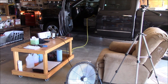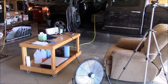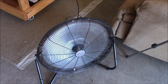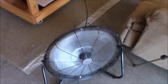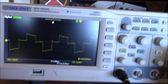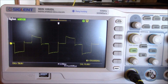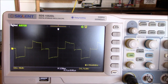A lot of vehicles have these outlets, so let's take a look. First off, I plugged in the shop fan and it sounds absolutely hideous — there's a hum and a weird sound coming out of this fan. Hooked up the oscilloscope and the waveform coming out of the inverter on the Chevy Silverado is ugly as sin. It's a modified sine wave, stepped type, but I've seen modified sine waves that look a heck of a lot better than this.